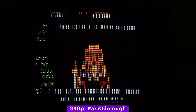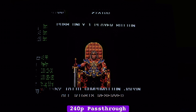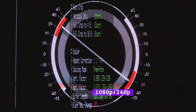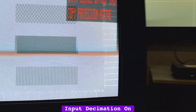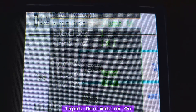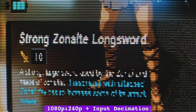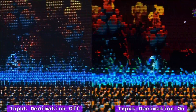The coarseness of line decimation is dependent on how low you've set the pre-scale, as going too far can sweep more resolution into the black hole that is decimation. You may also notice scaling bumps that can be smoothed out by altering the vertical cropping. Be mindful when using another profile as your template — it may have horizontal decimation shimmer. Look under the HDMI receiver menu and the input pixel heading to make sure they're set to off, as downscaling to 15kHz is all about reducing the vertical resolution, so decimating the horizontal axis will unnecessarily remove detail and cause horizontal shimmer.